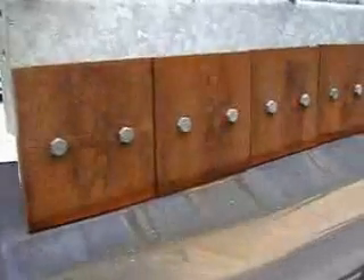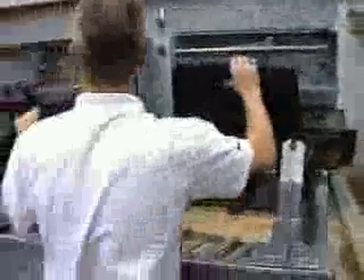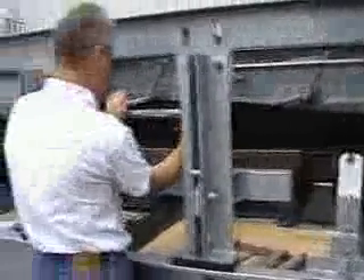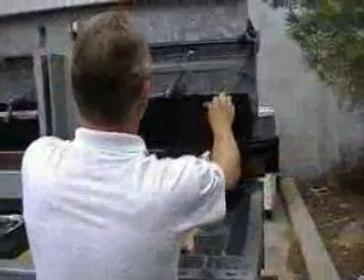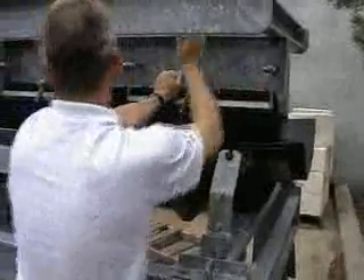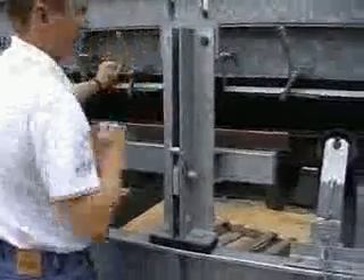All that's required now is we've got to go back around and put the skirt rubber on. It's a simple procedure. Slide it in, drop it in place. Make sure we're happy with the gap there. Lift it up against the actual bent plate. Rotate that around finger tight. Hold that in place, rotate that around, rotate the clamp around. Make sure we're happy with that — if not, just lift it a little bit more if need be. And just lock it nice and tight.